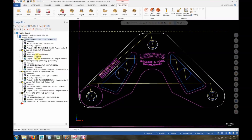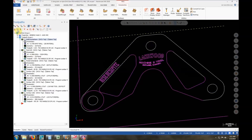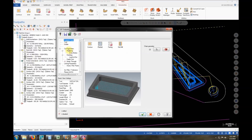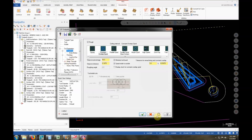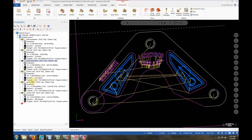After spot drilling, I'm going to drill with a 25/64 drill because I want clearance for 3/8 screws — that's the side screw I chose to use for that. After that, I'm going to go through and pocket out these two pockets using a 3/8 end mill. It's a very standard pocket. I'm leaving five thou on the walls to make sure I get into those corners tight. If I had been smart, I would have made sure the 3/8 cutter could fit right in those corners, but that's kind of a design flaw on my part.